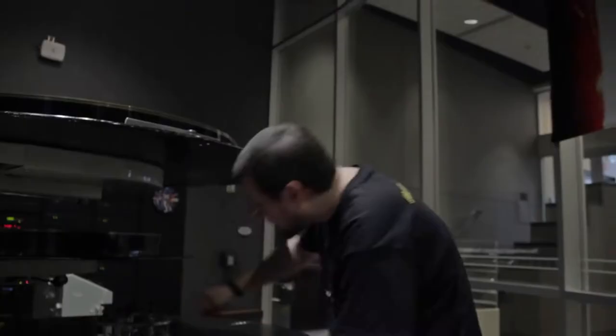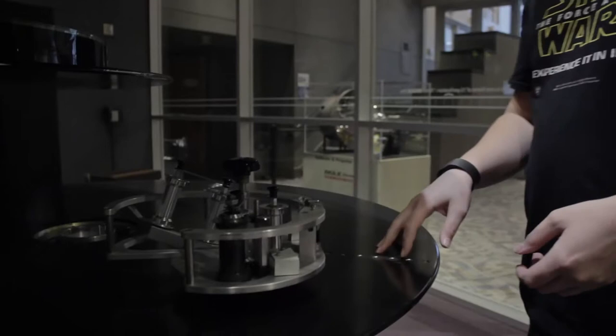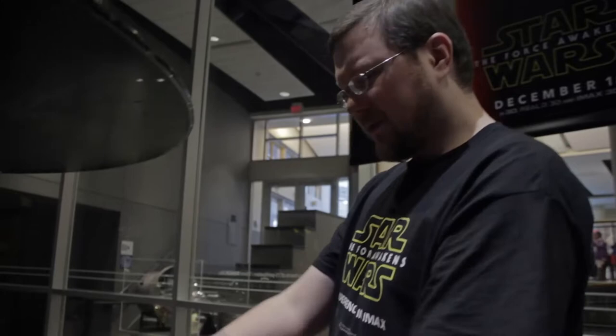So you always have to have clamps on it. Right here is our key control unit, also known as the brain. The brain basically regulates the speed of the platter while the film is pulling through the center. The brain controls how fast it spins going into the projector, and the tension arm controls how fast it spins coming out of the projector.